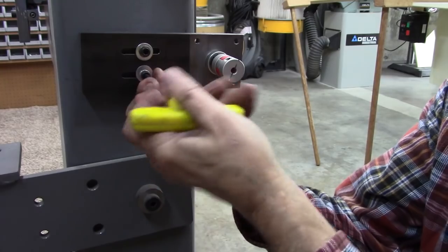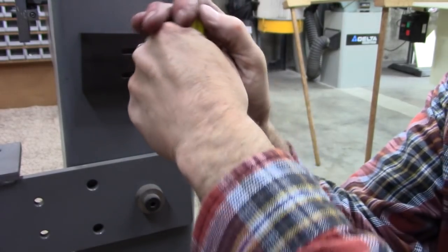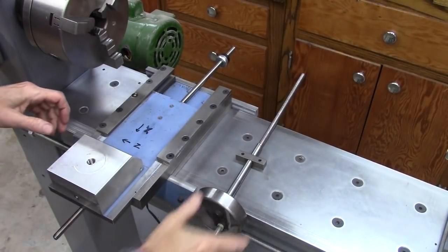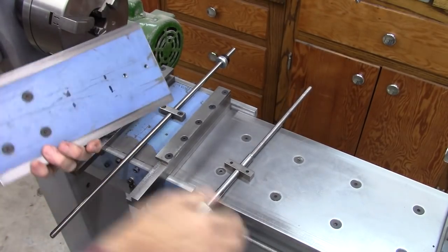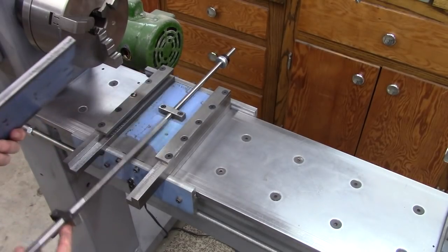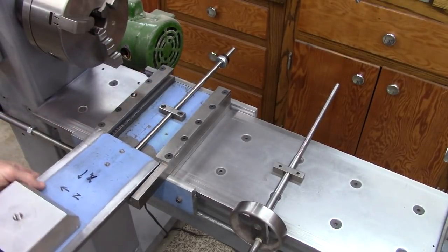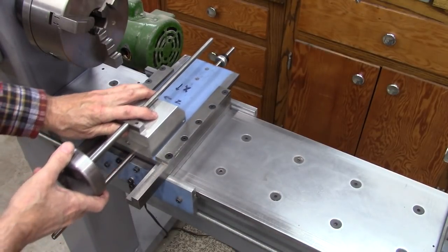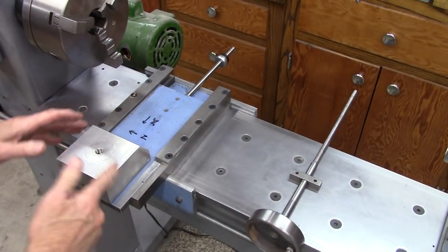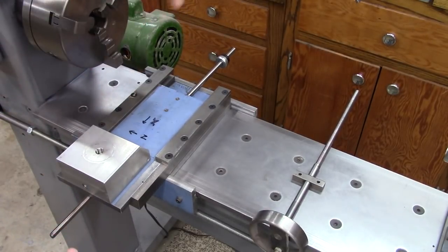Still moving free. I had the cross slide with the nut bolted to the bottom, and it went into that nut right there. I'm going to move that nut, and the reason is because this adjustment moved with the cross slide. If I'm going to make it CNC I'd just as soon that servo didn't move — I was going to put the servo back here, but I don't want the servo to move in and out with the cross slide.